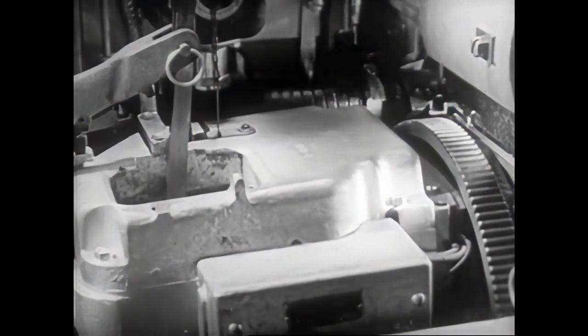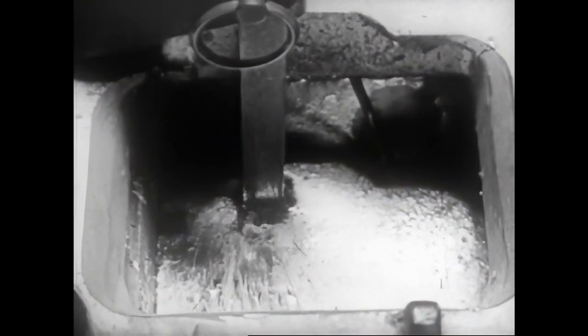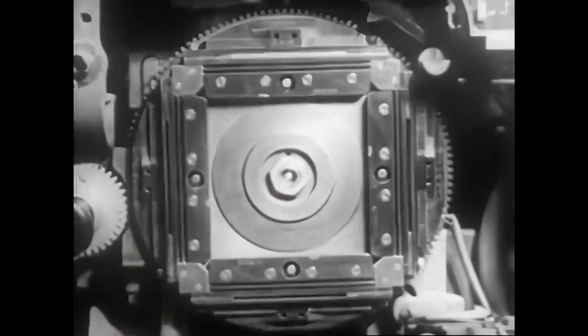The metal pot advances against the mold, locking the mouthpiece tightly against the mold and the mat. This is the instant in which the plunger injects the molten type metal into the mold under pressure, casting the slug with the letters in relief. The plunger rises, the pot and the disc retract, the justification block comes down.